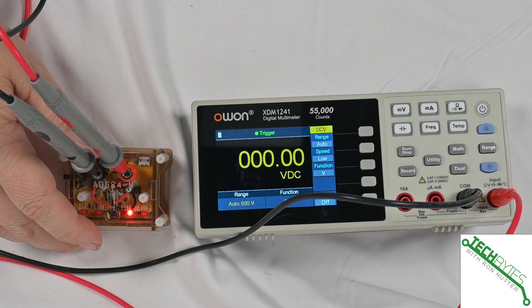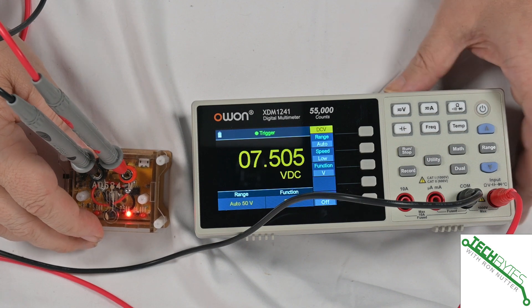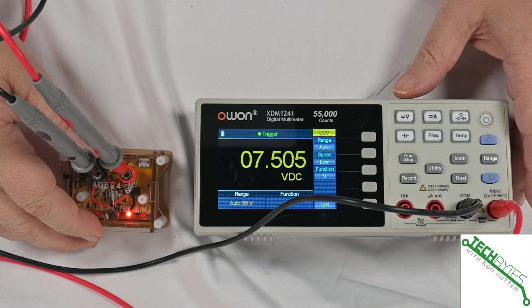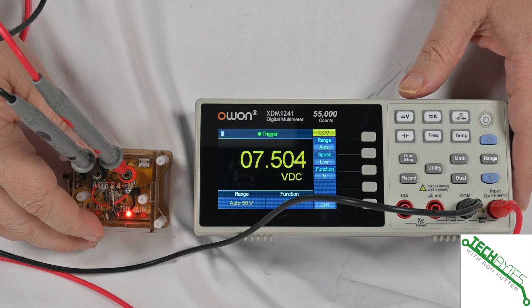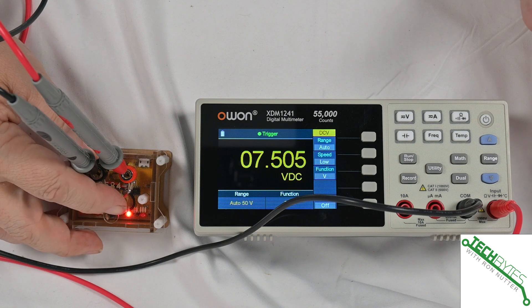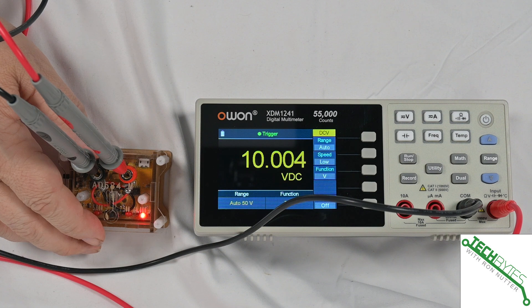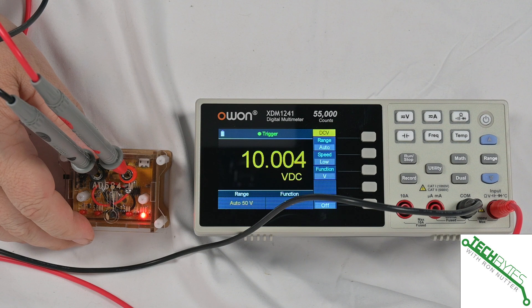We'll take one more step up. You'll notice it clears because it senses a change in the voltage. So 7.50, and it's got that one last digit that may fluctuate a little bit — you can see it's flipping. This may be because I just turned the meter on and it may not be totally warmed up yet, which is interesting to think about for an all solid-state device. Back in the tube days that would have been expected. I'll press it one more time — and it's solid: 10.004 volts. You can't ask really any better than that for this device, though yours may not give the same readout, and that's where you'll have to learn what's unique about your equipment.